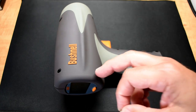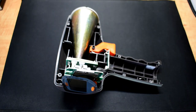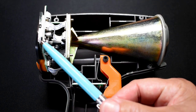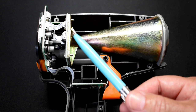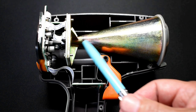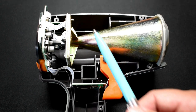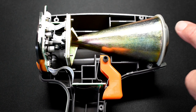Eight screws have been removed — four from the handle and four from the top. Here we have a very simple spring-loaded switch that makes contact right there. You have the small board, and there's another board here that has the LCD display and a microprocessor I'll show you in a minute. Over here is the radio frequency section. This is all metal. Inside here you have the microwaves generated, directed into this cone-shaped antenna, also known as a waveguide. The microwaves come off the end, bounce back, and get collected in the same tube where the microprocessor interprets the speed. That speed is then displayed on the LCD screen.